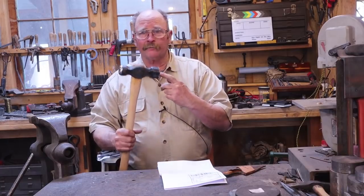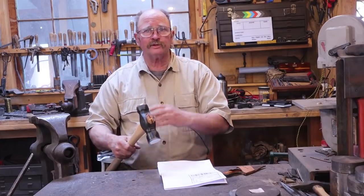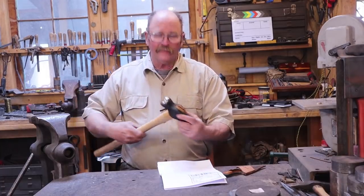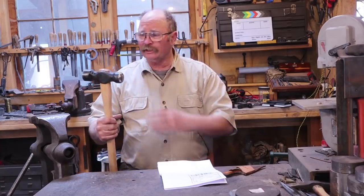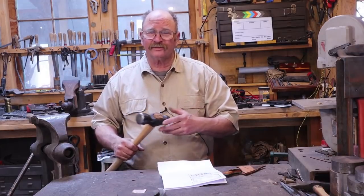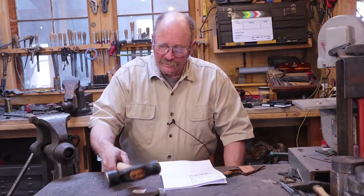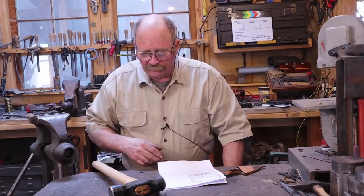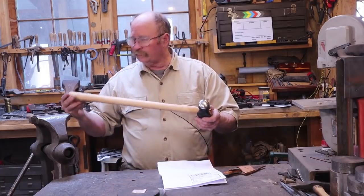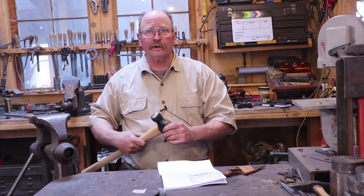This should be a great hammer to work with. It's heavy enough and has a long enough handle that it will be a good hammer for a striker, especially for more delicate work. But it's also light enough that I can work with it one-handed if I need to. Every now and then I do want to swing a 4–6, occasionally an eight pound hammer, but I'm no Brent Bailey and I can't swing an eight pound hammer all day. This one with a handle comes in at four pounds thirteen ounces, so that's probably about a four pound head — a nice practical hammer that crosses between a small striking hammer and a large hand hammer.